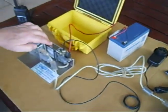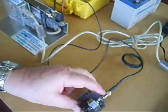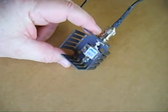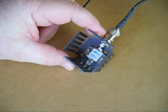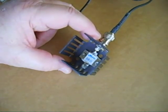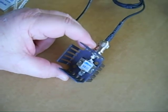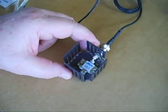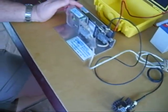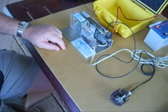The transceiver, or the data radio, is actually in this configuration talking to a heat-sinked 50-ohm resistor here, acting as a dummy load. It works extremely well, and we can get about a 100-metre radius out of this, which for our applications is very good. The data modem itself is capable of running from 1 to 5 watts, and we're running it on the low power of 1 watt. So even with 1 watt into this dummy load, it has quite a usable range.